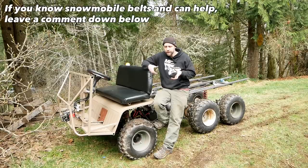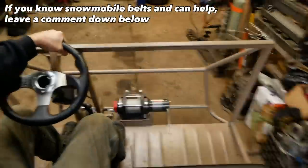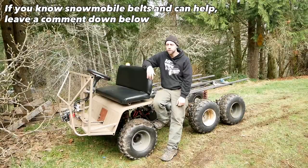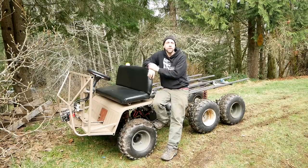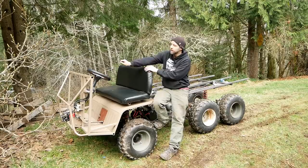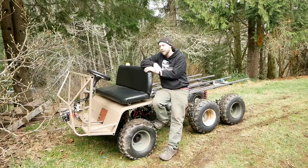And so basically it's squealing when you're holding the brakes on and transmission brakes going on. And that load, with the motor trying to power the transmission because the belt's too tight, also makes it hard to shift in and out of gear. A few little teething issues like that. Plus we got to relocate the keyed ignition and a choke up front here, so I'm not reaching over the seat to start it. Things like that.